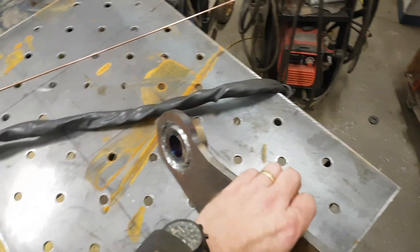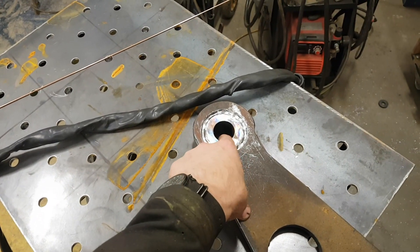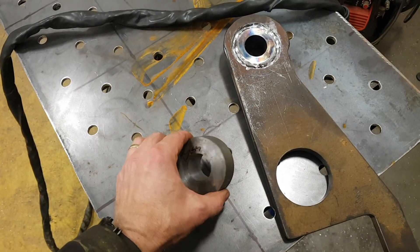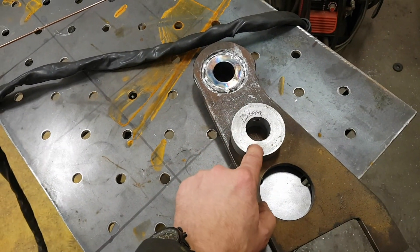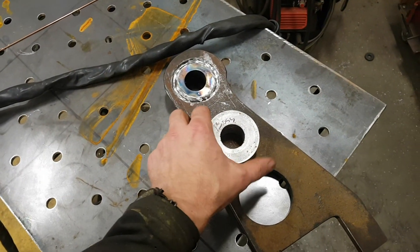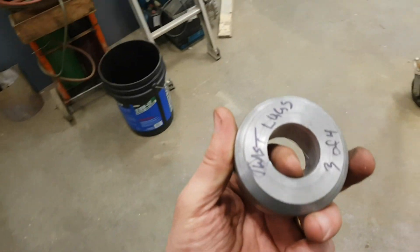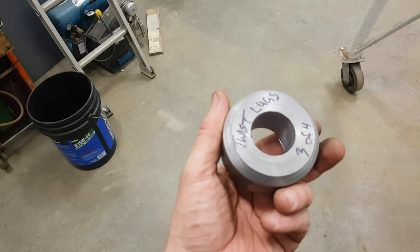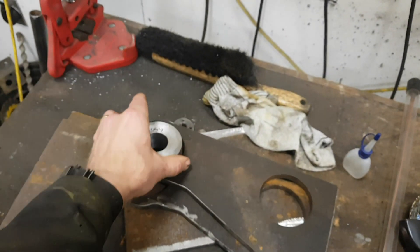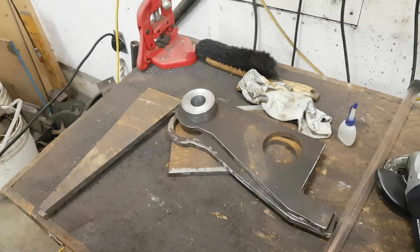Being bored out a little bit there doesn't matter as much because there's no shaft going through that one. One of my lugs for the twist adapter happens to be slightly undersized rather than bored out larger, so basically I've got one spare — that was my one free screw-up. I just have to tighten up that bore a little bit, get closer to spec, and then I should be able to do the same to this pair. So let's try that instead.